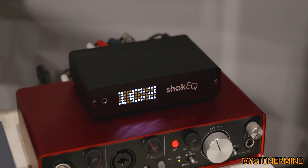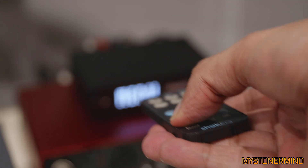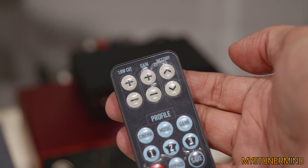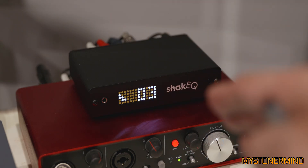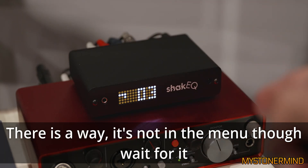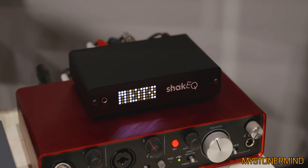I'll show you the menus - they're pretty straightforward. You've got to keep hold of mute and then press down on the wet/dry buttons. That there is a frequency generator, press OK and it starts off at 99 hertz and goes all the way down to about two or three hertz. Most of the menu is strictly for the shaker - it doesn't do anything to the sub, which is what I was thinking you'd be able to do. There's also a low pass filter, which is also for the shaker, so you can set that where you want.